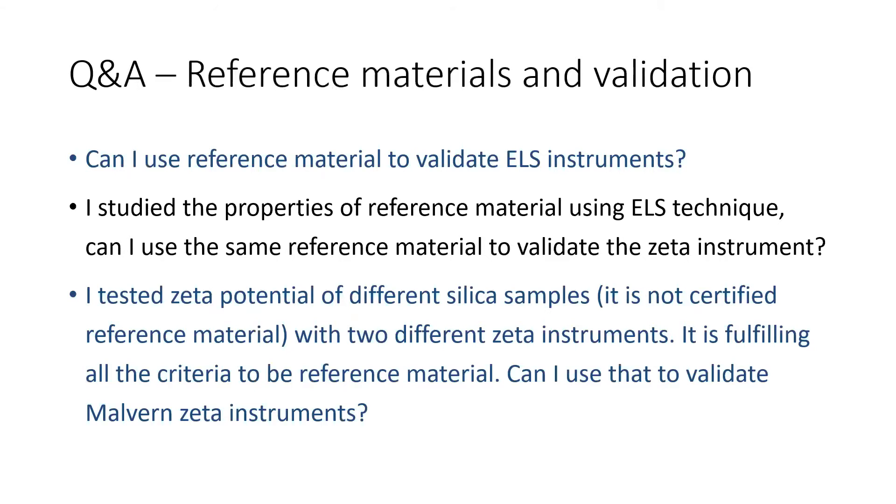You'll need to work with your validation team and statisticians. One thing to be aware of, especially for high salt concentration samples, is the suitability of the electrodes. The problems I've described with electrodes are worse at high salt concentration and change with time. The electrodes deteriorate, especially gold ones. If you are running lots of samples above a few tens of millimolar with gold or palladium dip electrodes, you must take this into account. Just because your instrument gives the right value for the reference standard doesn't mean it's performing equally at higher salt concentrations.